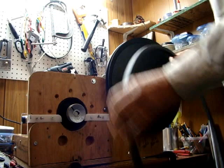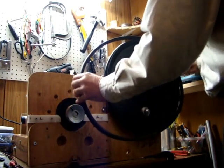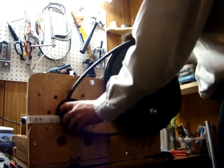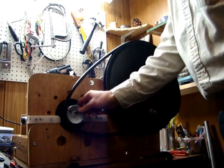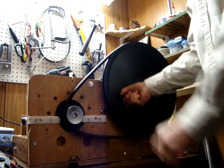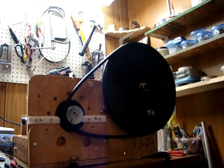I'm just going to put the belt on here. This belt is a 62-inch belt, and I've got a fairly loose tension between the two pulleys. I don't want it too tight because I don't want too much angular tension on the generator shaft nor on the bearing in the plywood, but this is enough to give a good connection between the two pulleys.